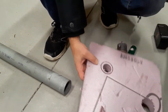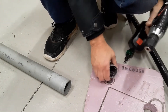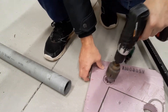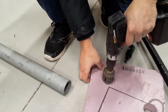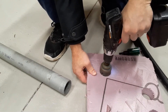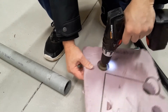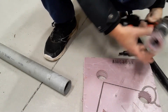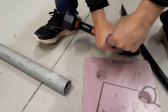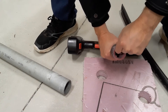We're going to use some polyurethane. Now you take your bigger outside diameter hole saw, and if the pilot hole is not there your bits are going to walk, so that's why you do that indentation to keep it nice and centered. Just drill that right through and you've got your little sleeve. Do this a couple more times to get more sleeves — they pull out pretty easy. You shouldn't have to use a screwdriver or anything, just grab it and pull. It should come right out of that hole saw.